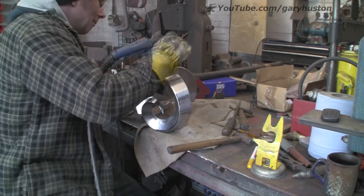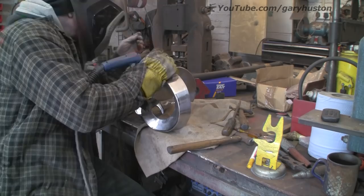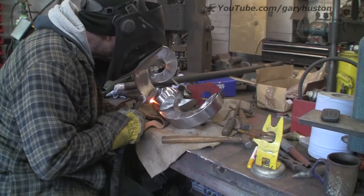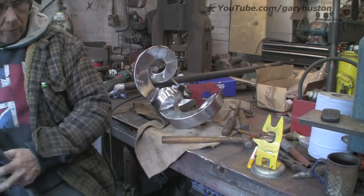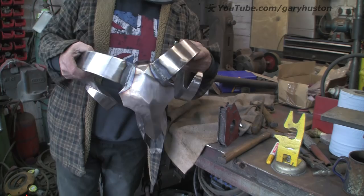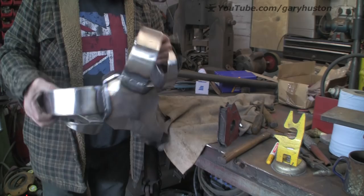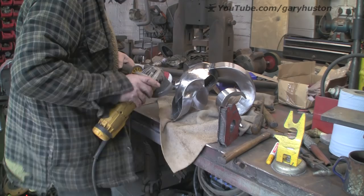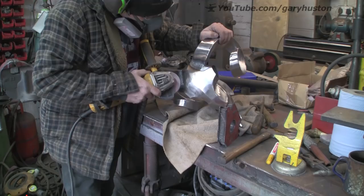I'm going to use as little filler material as possible here, although across the top I want to put a fair bit in because I want to blend them nicely. There's a few gaps underneath which I'm not really too worried about. So done. Again you can see the horns aren't quite level — one's a bit higher than the other. I'm going to clean that off and that will be my lot — I'm going to call it a day. I'm going to start with the flap disc again, then I'm going to try that blending disc and see how that performs.